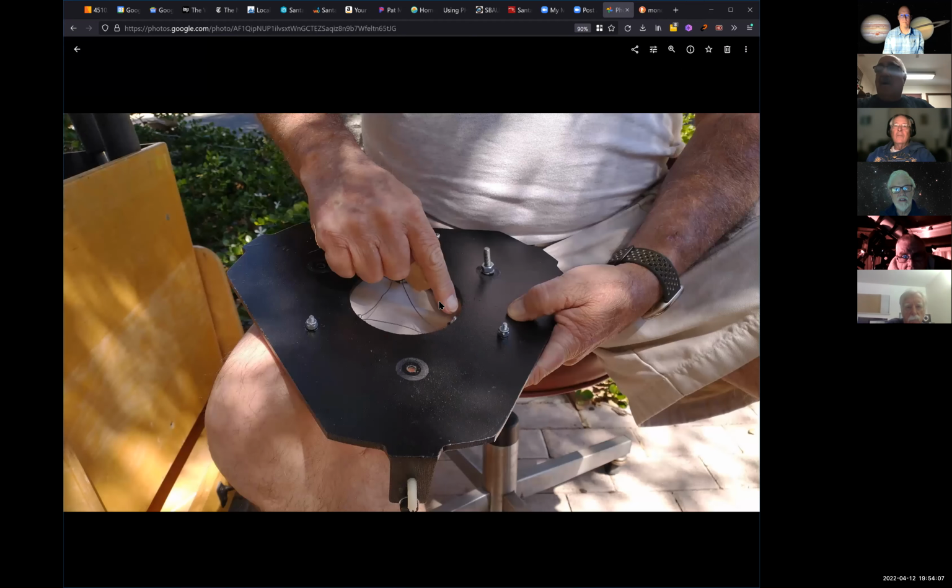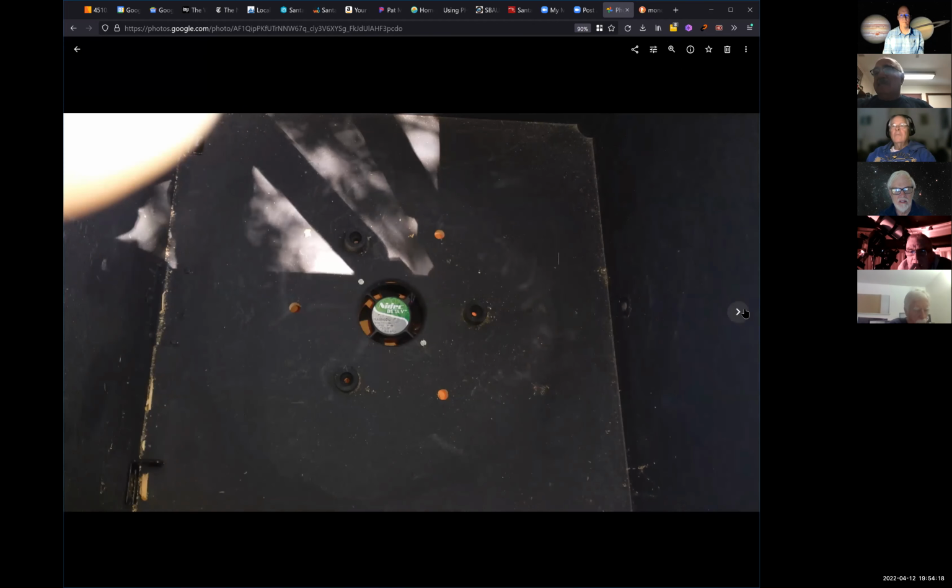And what they're doing to collimate it, it's like Tom described it, you're just kind of crushing these little rubber circles at the bottom of the mirror box to get it collimated. And it is the biggest joke I have ever seen. They're using it instead of springs. Yeah, that's your springiness, the resistance to your screw. Yeah. Right. It's horrible. And after a few years, the rubber's going to lose its... Yeah, it's going to get harder. It's been 30 years so far.